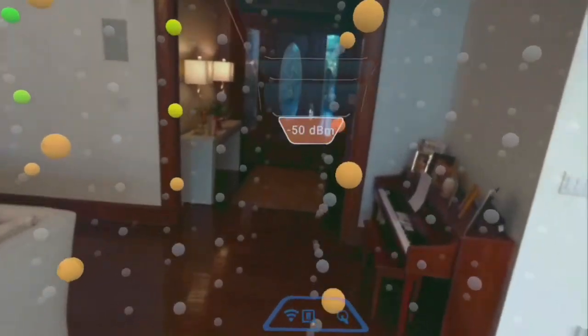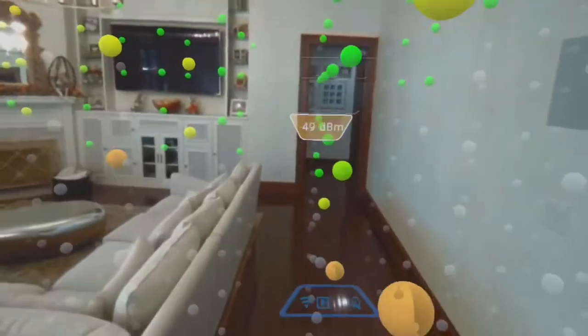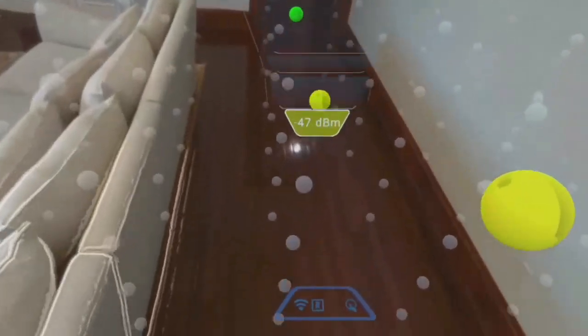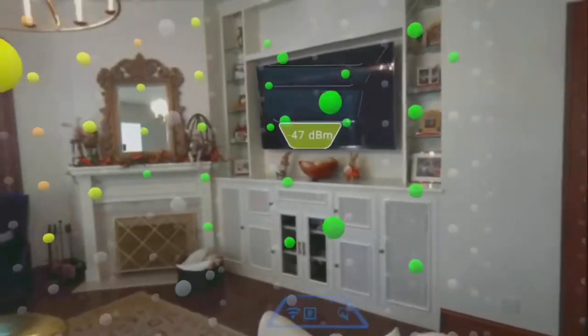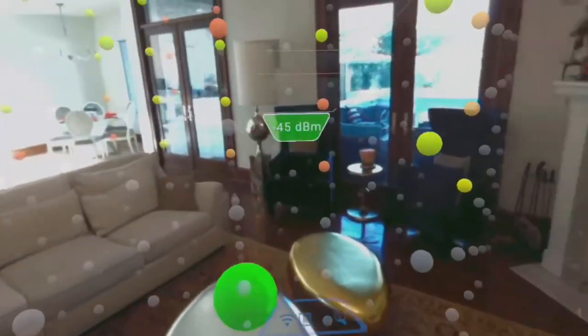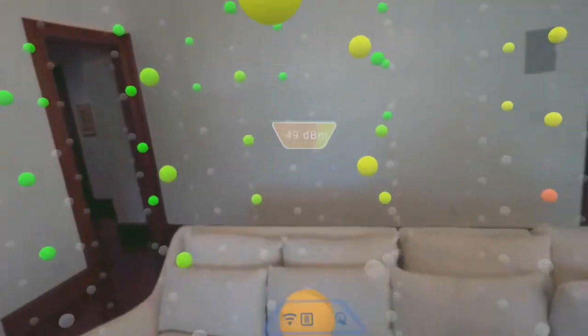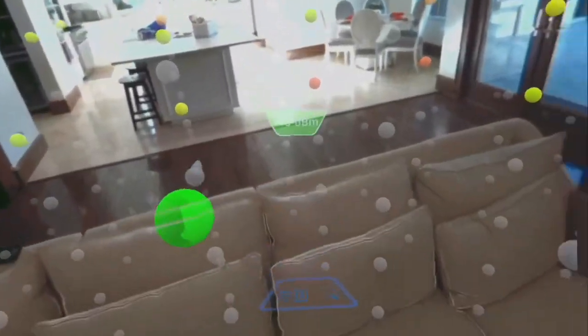This is connected to a Control4 or a SnapAV access point that I use for my Control4 remote controls. It's actually sitting in a closet back around that hallway that you saw there, so it's in a very specific location. I try and keep that signal nice and low. But this is on 2.4 gigahertz. The output power on this radio is turned down a little bit just because, like I said, I only use it for the remotes.